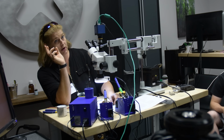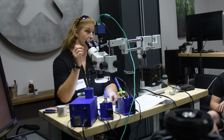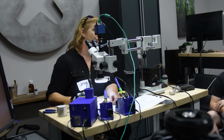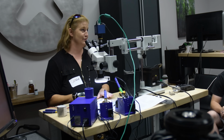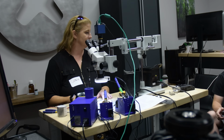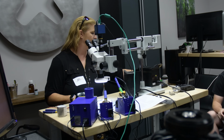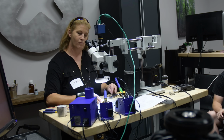You don't have a board problem until you know you don't have a parts problem. Maybe you have a parts problem. Maybe this board's fine. We don't know. So rule number 1. We're not going to do a thing to this board until we rule out rule number 1. So that means we need some known good parts. Do we have a DC power supply? I can find you one.